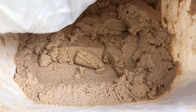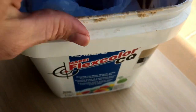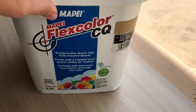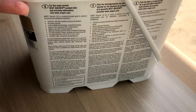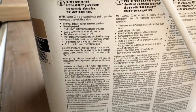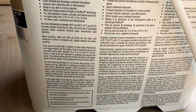Sometimes when you mix your own grout it's easy to add a little too much water or a little less than you need, and it can cause discoloration or not as nice looking grout. So the pre-mixed stuff is always my go-to — it's really not that much more expensive. Just be sure to always follow the directions on the container for your type and size of grout when you're doing this job.